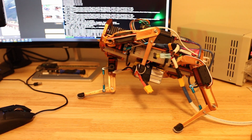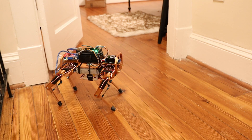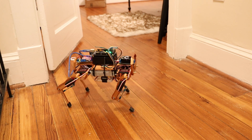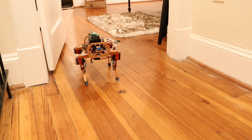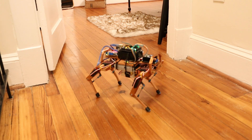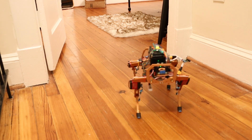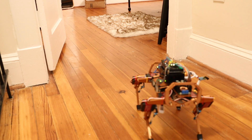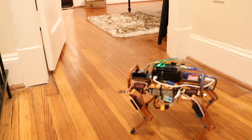Well, that shut it down pretty quick. After a couple hours of trying things out, I think I figured out what's wrong with the robot. When I make small maneuvers, it's able to run fine. But when I start taking bigger steps, I have to keep the speed down. When I start going too fast, I start running out of electricity, and then it's not able to keep moving the way it needs to in order to stay walking and standing. But as long as I make small motions, it works just fine.